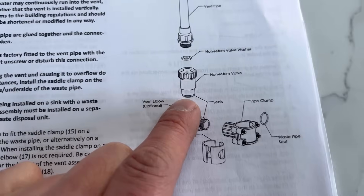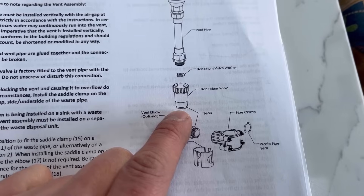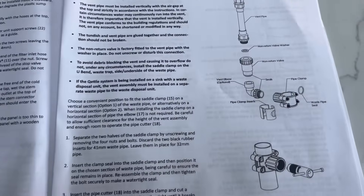That's why you should always read the instructions. It had a non-return valve in that tall section of tundish pipe. It's obvious when you're looking back at the video as well - there's an arrow on it - but I didn't read the instructions, I glanced at them. You should always read them. So I didn't need the stand pipe or the trap, but I also did need to alter the waste pipe and bring it over, so I still needed to fetch the pipe over anyway to connect to it. We know for next time, and you can learn by my mistakes. Always read the instructions.